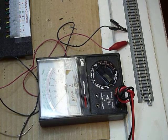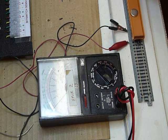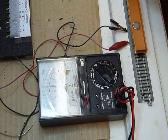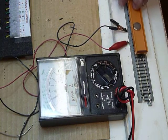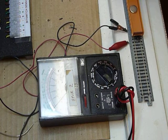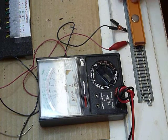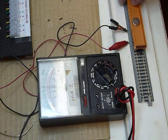I have a magnet in a small gondola car, and as I move the magnet forward you will see the ohmmeter needle move and drop, then move again. The magnetic field as it goes over the end of the reed switch will cause it to close — you can see the indicator on the ohmmeter.